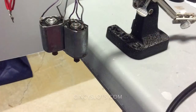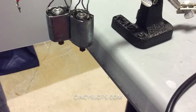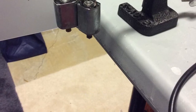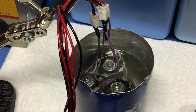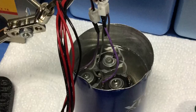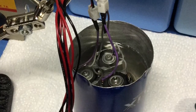After the 24 hours, I'll pull it out, let it drip dry, and then take my compressor and blow out any excess WD-40 fluid. Then once I'm satisfied that it's dried out, I will dip it in the electric cleaner and let it run in there maybe 5 or 10 minutes to make sure it's nice and clean and there's no WD-40 residue left.